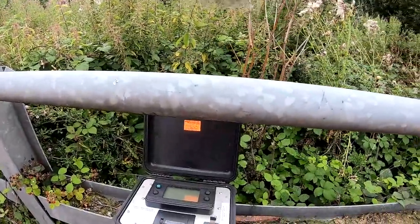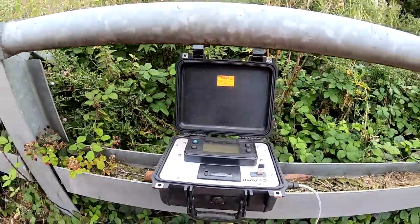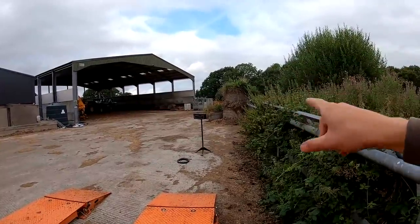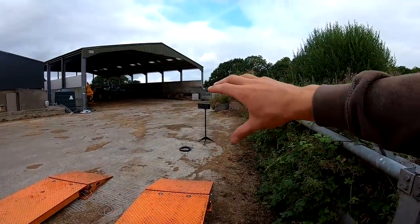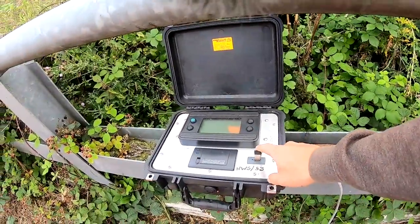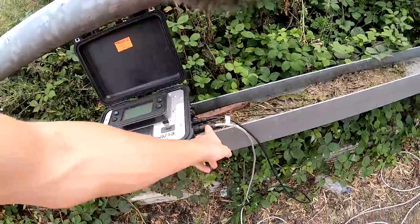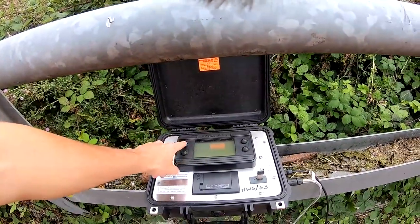The box is charged up to 100%, but you can also run it with a power lead if you're using it all day. The traffic light display will be positioned back by the bales so you can see it whilst weighing. You need to weigh the tractor on the bridge and then the trailer axle separately, so you need space to drive off and still see the display. Memory stick is in, and there's a little receipt printer for recording all your information. I've got everything plugged in — moment of truth. Hold the green button to turn on.